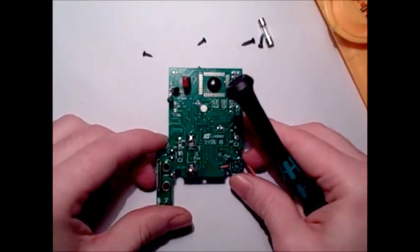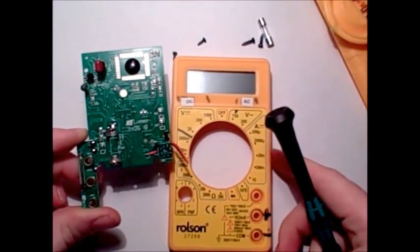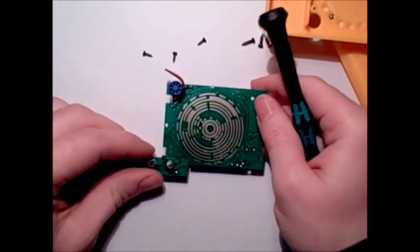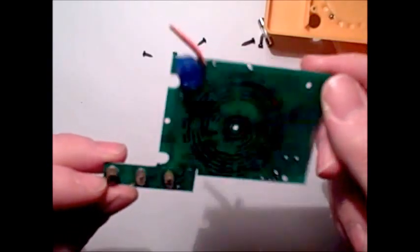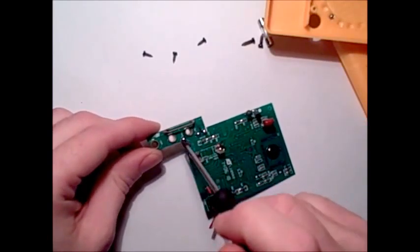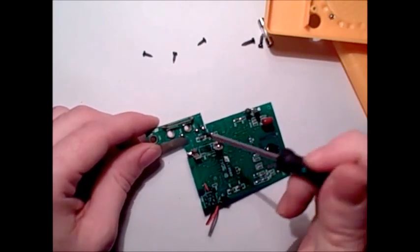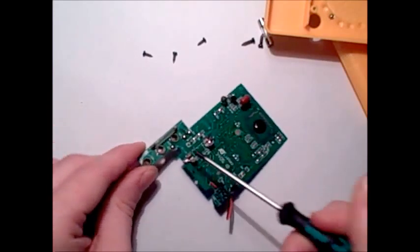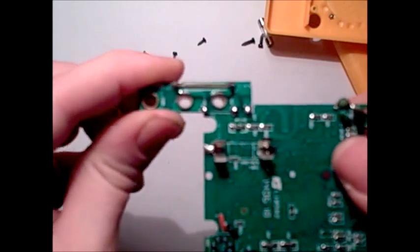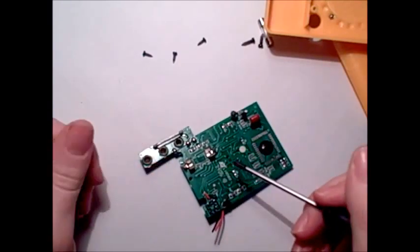If I was rating this as a meter, I'd say I would be happy using this for no more than about 12 volts. I'm not massively happy considering that this part here is actually a circuit board which, during manufacture, comes off the other half of the circuit board — they snap it and move it round, making the PCB cheaper to produce. However, they've just literally bridged solder across from one side of the PCB to the other. There is just a small amount of clearance between the two boards, and that's not the best idea.